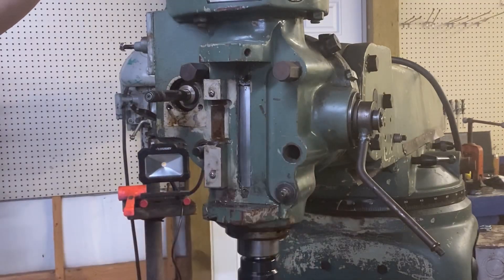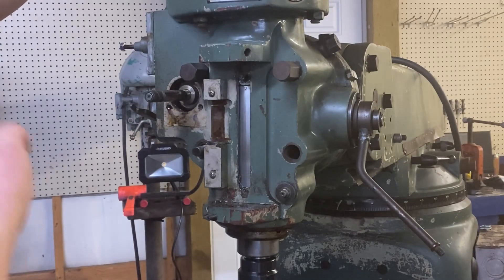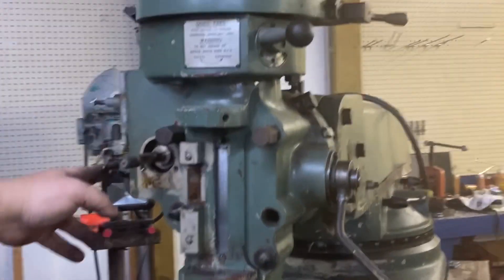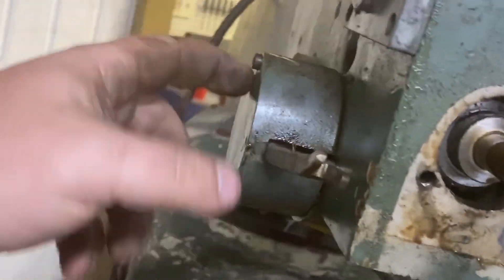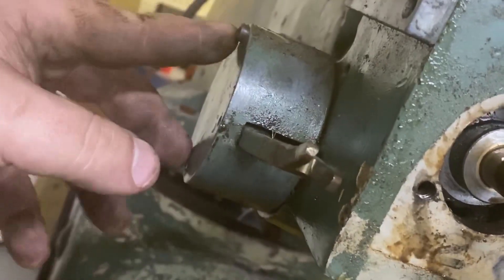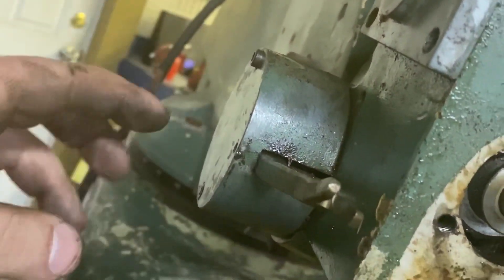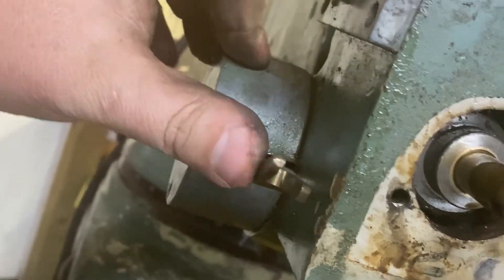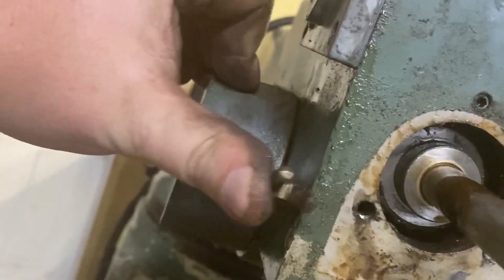There's two snap rings. So pretty much all the power feed stuff is off. There's still this piece — there's a big spring underneath this arm, there's this arm, a washer. I backed that out just a little bit. This cover compresses against this and compresses against that spring to get the snap back.